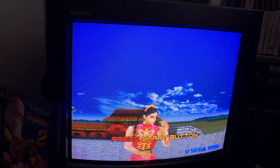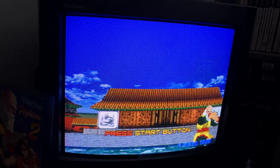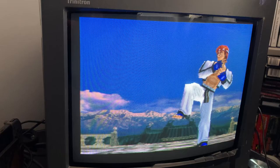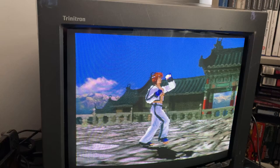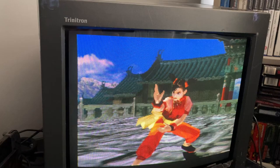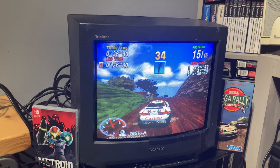If you want to get into retro gaming without spending a fortune on a screen, look around for old broken CRTs. The rules are: if the screen is cracked, the tube is broken, or the front of the actual tube has any damage, forget it — it's not fixable. If you look inside and there's smoke and burnt-out parts, that's probably dead too. But if it just doesn't turn on, has flashing fault lights, lines on the screen, or distortion, those are all fixable. You'd be surprised how many CRTs get thrown away that are perfectly repairable.